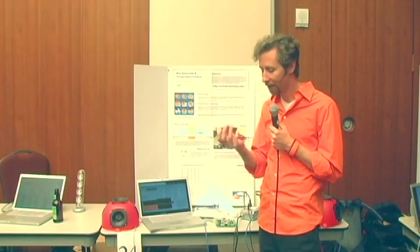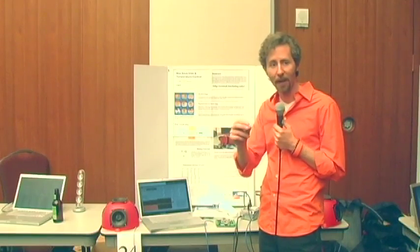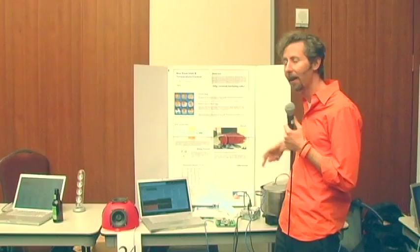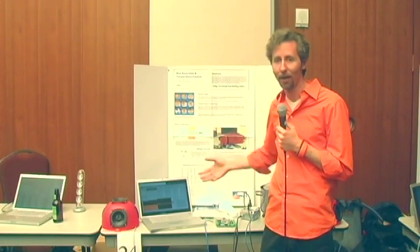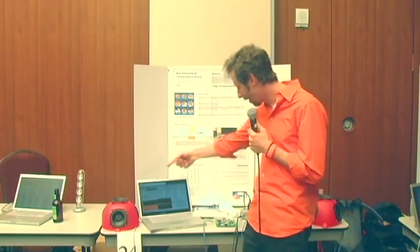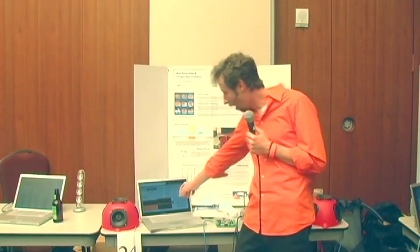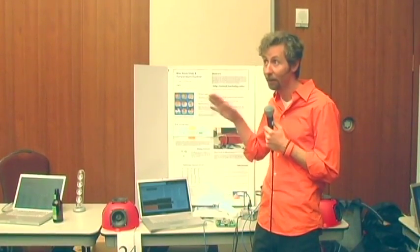I'm Michael Spashinski, and my application here is using Max as a temperature controller, specifically for sous vide. Sous vide is a method of cooking where you vacuum pack food in a bag and cook it at a very precise, probably low temperature. Right now I have eggs in here at 148 degrees Fahrenheit, which is 64.5 degrees Celsius. Max is doing all the work to keep this pot at exactly that temperature. There's a temperature sensor here in a copper tube running into Max, and my controller kit is triggering a relay to turn on and off a hot plate. It's checking and parsing every quarter second, and the temperature has been at 148 really regularly for an hour and a half now.